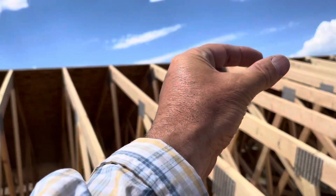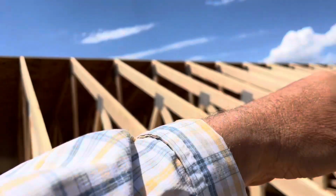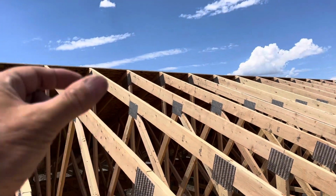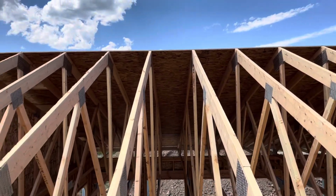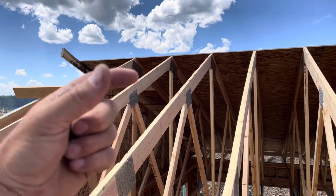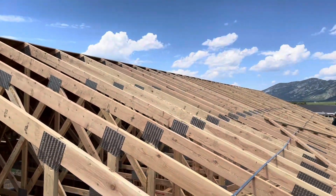We're leaving a 2-inch gap at the top so we can do what they call a roll vent. And the roofer will do that, but we'll leave about a 2-inch gap. He said he could cut it or we could just leave it there, but we'll leave it there ourselves. So he could do a roll vent the whole 90 feet.